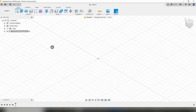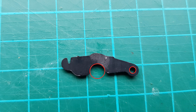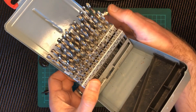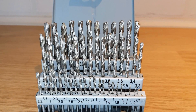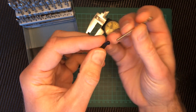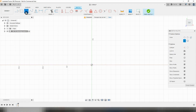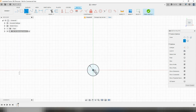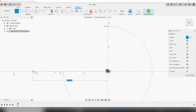Once we have Fusion open we can start creating a 2D sketch of the shape we want. The critical dimensions are the diameters of the holes and their relationship to each other. There's also a straight edge which intersects the centre of one of the holes, which is really helpful. One trick for measuring small hole diameters is to use a good selection of drill bits — I have a set ranging from 1 to 6mm in 0.1mm increments. Make sure of course you don't use the sharp end. The small hole here is 2mm with the external being 4mm. We can then draw these on our sketch in CAD, all centred around the origin where all of our axes meet. The straight line extends out to the left so we can add that in now too.